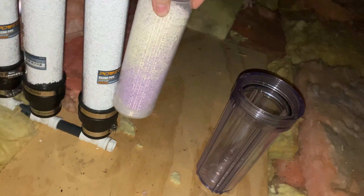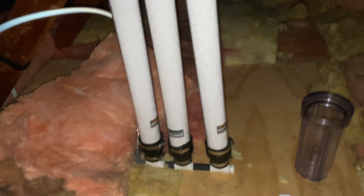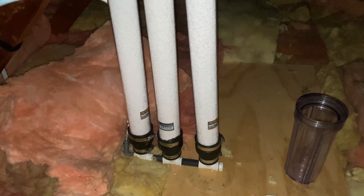The new reactor is installed, and as you can see it has much more media than that one tube. The old one is about two and a half inches wide, this one is two inches, but it's about two and a half to three times the volume per tube. I'm really hoping this will last a long time. If you look inside the old one you can see what got used up — there's channeling because it was angled slightly, so air took the path of least resistance. Whatever section was off-angle is what got used; the rest didn't get fully utilized. With this new one I'm making sure it stays mainly vertical. The more vertical and slightly random the media packing, the less chance of channeling.